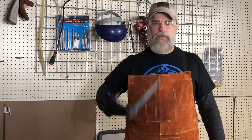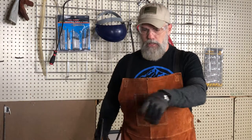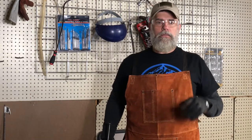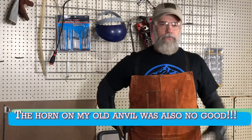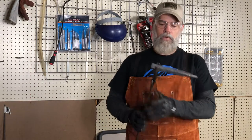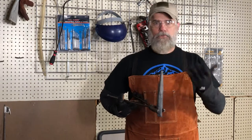This is a much wider piece of metal to widen something out than I previously had. All I had was my center punch, and that wasn't wide enough. Once I got the center punch in, I couldn't get it over the horn of the anvil, so it was very difficult to open the hole up a bit to make an actual bottle opener.